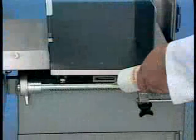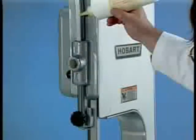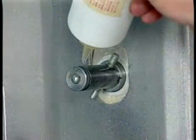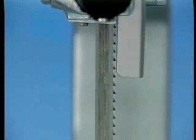Frequently apply a few drops of oil to the gauge plate rack, upper blade slide ride, and the pulley shafts. Check to assure that each component moves freely. To change saw blades, disassemble the components as described in the cleaning section of this tape. Reinstall the blade so teeth point to the right and down.